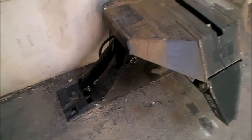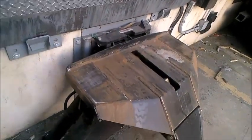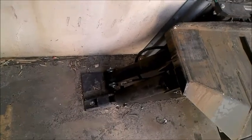Now we've just got to wait for the red light to come on and then the green light. Red light means they're loading me; green light means they're done. This is kind of a different design — your DOT bumper comes in here and they use it to support the rear of the trailer as they go in and out with the forklift, and they've got shocks in here to help absorb impact so the trailer doesn't get beat up. The older design over here has a hook, so if the driver had an idea to drive off, he couldn't — the hook would catch the trailer and rip the bumper off. That also is an accident report. Walk back and check things; don't just trust the green light.